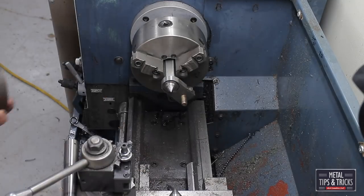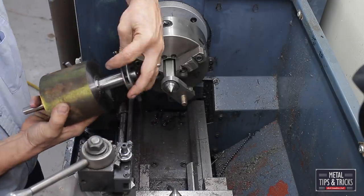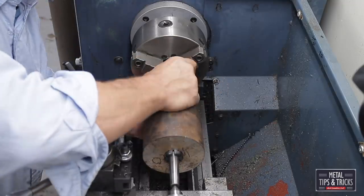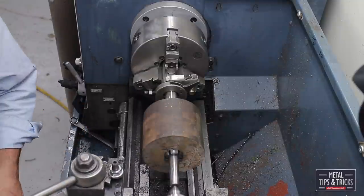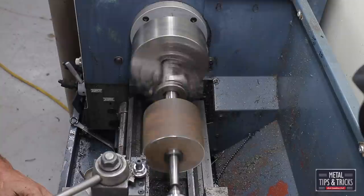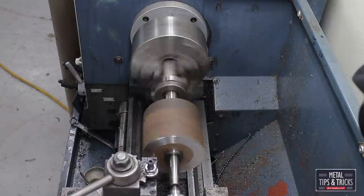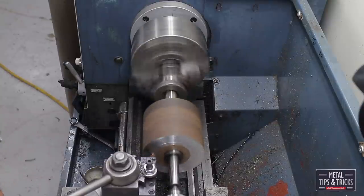And this is our adjustable mandrel, and an interesting dog to drive this. It's actually used more for grinding. They're self-tightening and you can take them off really easy. Really enjoy using these. Coming in, cleaning off that surface. I don't have to go in all the way because later on I will actually cut a bearing seat where you see that I haven't finished it, so that'll all get cleaned out later.